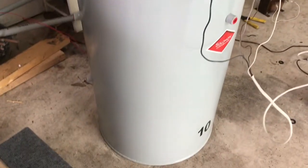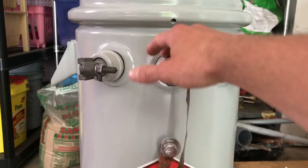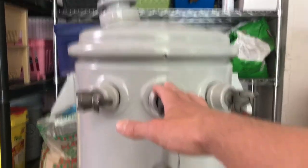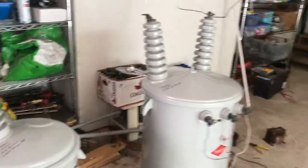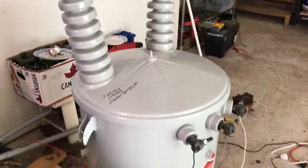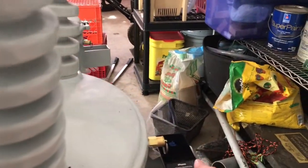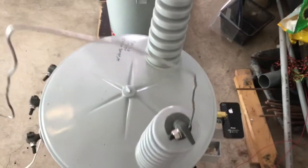This one here is about a 5 to 25 kVA can — my power company has tons of these small transformers around. It's a 13 kV system also. When I picked this up I couldn't believe it — this is like a 50 to 75 kVA can. I'll put an iPhone out on the hangers to show the scale — it's just a big pig.